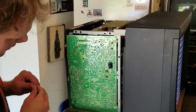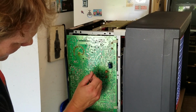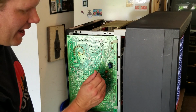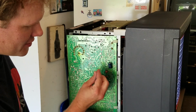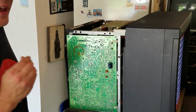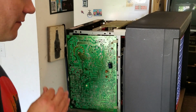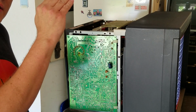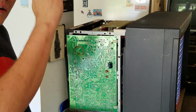Okay, and if we keep going down here, you'll notice that if you come to the left of that, you'll hit this other potentiometer, which is not marked with a white hole, and it actually is just a smaller metal potentiometer, tinier hole, and it has vertical center, V-cent. That is, again, just like the horizontal center, that's your vertical center. So if you need your picture to go up, you're going to move that until you start seeing the center go up and then the center go down.